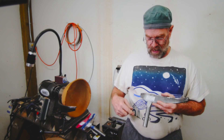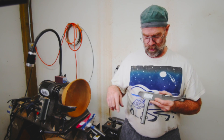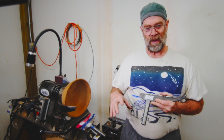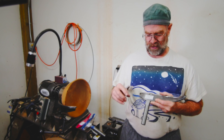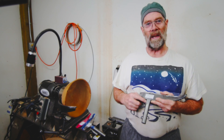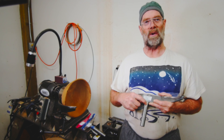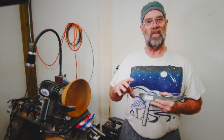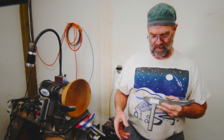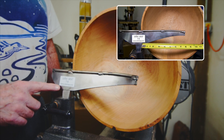This bevel was an afterthought — it looked good on paper but when I got it out to the actual lathe it didn't work quite as well. For 16-inch, 20-, 24-, and 25-inch lathes this is not a problem, but for the 14-inch lathe this bevel sits right where the set screw needs to go. So: 12-inch and mini lathes — they'll work; 14-inch lathes — no; 16-, 20-, 24-, and 25-inch lathes — they work fine.